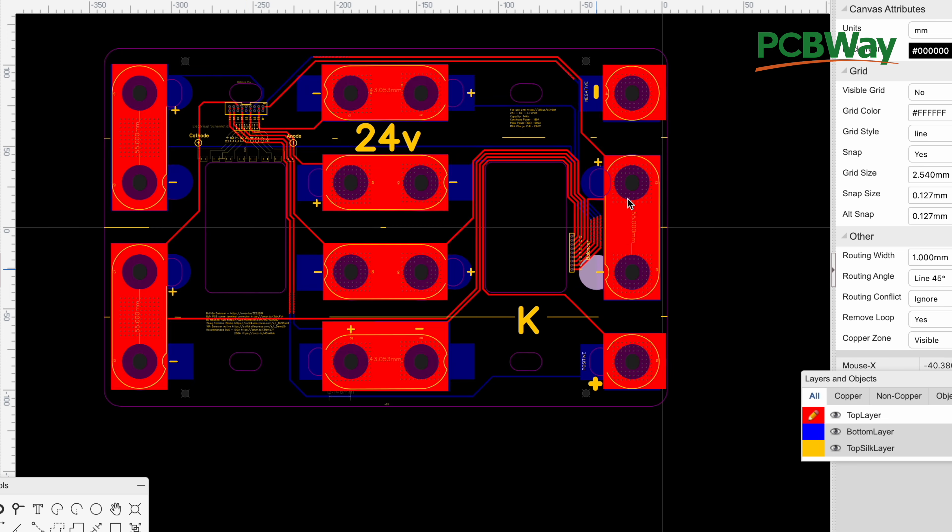This definitely makes a difference when you're ordering a hundred of these boards. It'll be the difference between $800 in shipping or maybe $500 to $600 — you can shave hundreds of dollars off the cost just by doing that. We definitely don't need FR4 or PCB material in certain areas, so we take it off. And the vent holes on the cells serve a purpose and also lighten up the whole thing.